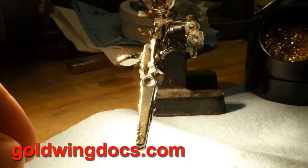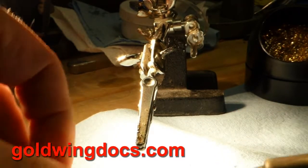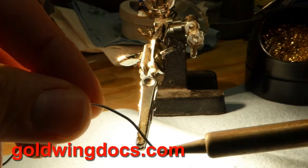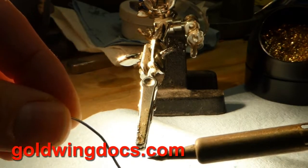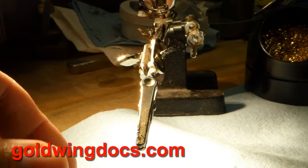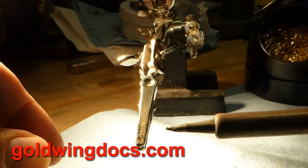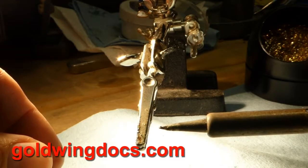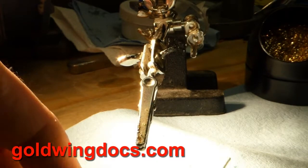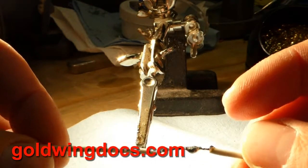So that's it — we have our normal method using the soldering iron: heat the wire, start the solder by touching the tip of the soldering iron, it's going to suck the solder into the wire, then move the solder along the wire as you go. Then we have our emergency method with the butane torch. You can also use a soldering gun rather than a soldering iron — it doesn't have quite as fine a tip, it puts out a lot more heat and is less controllable, but it works for larger joints.